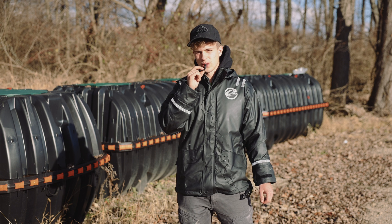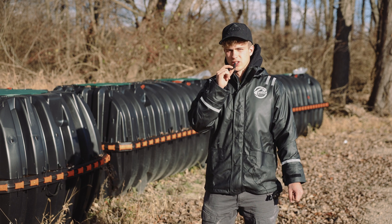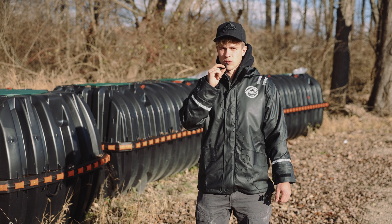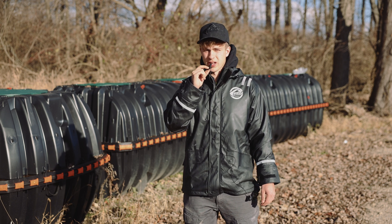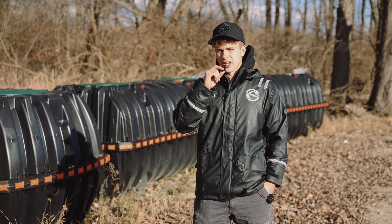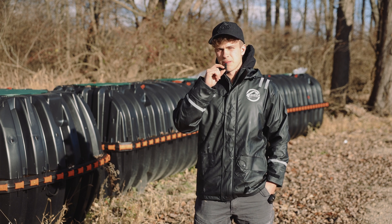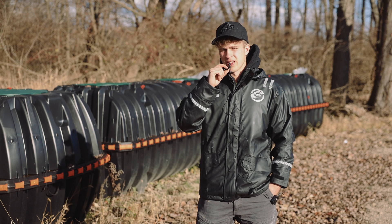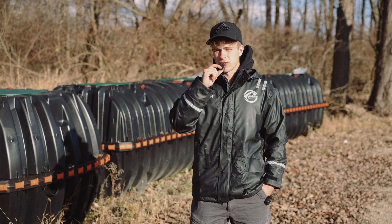The second advantage is that they don't corrode like concrete tanks. So in some counties where corrosion is more common in concrete tanks, they will require us to install a plastic one. Really the only downside to plastic tanks is they tend to pop out of the ground if there's a higher water table, because they don't weigh a lot. In that case, concrete tanks are preferable.